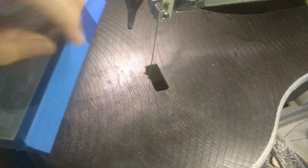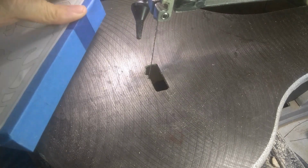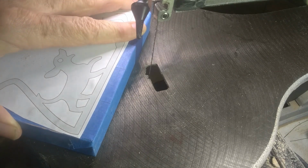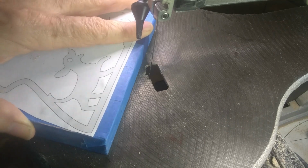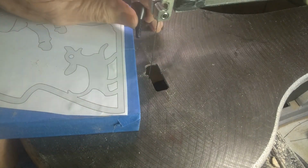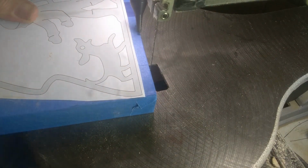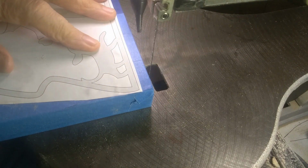I've got a number 7 in there. Didn't want to get too much larger. It's very aggressive cutting a big piece like this. Sometimes hard to hold down on the table. It can get very jerky if you get a thick piece with big teeth. So this is the biggest I want to go with the teeth on this. It doesn't always do that, but sometimes gives some problems. So I think it'll cut this 1 inch. That's what it totals up to, 1 inch. I think it'll cut it okay. So here we go, we'll find out.